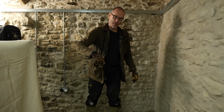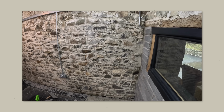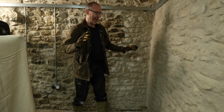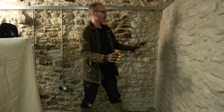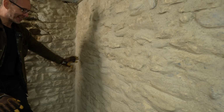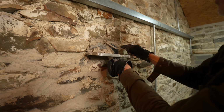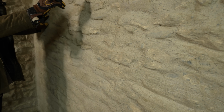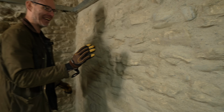Okay, so the footage that you were watching was from a couple of days ago, the first day of working here, and the GoPro died before we did. We carried on working after the filming stopped, and we jumped forward quite a bit. I'm going to bring you up to speed, because we've got walls that are now looking like this. This is walls that have had the big holes filled in with the mortar and stone mix, and then a little bit of pointing done where it was needed, and then on top of that, a slurry.